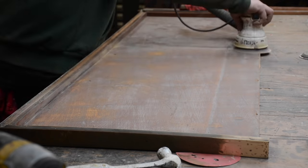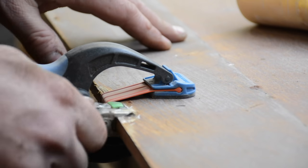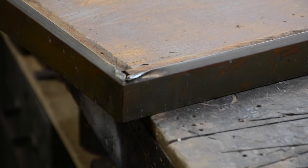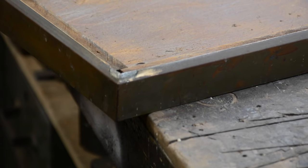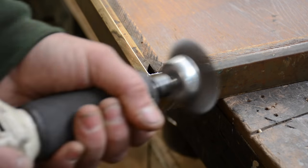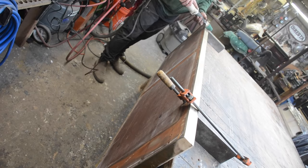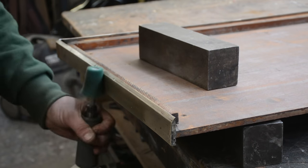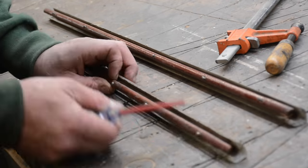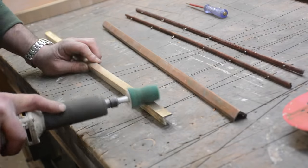You can see how easily that varnish is just sanding off — that's got to be the original paint, it just comes right off. I just get off what's loose, fixing all the cracks. Like I said, this wasn't a perfect restoration — it was really more of a rehabilitation. Now I start to confront the joints. The two uprights that you saw in the very beginning would have been soldered there. I contemplated soldering it, but I realized if I soldered it I would have had to heat up the whole joint and all the parts, and they were probably soldered before some of the wood was put in. So I didn't want to risk softening up the soldered joints that were still good.